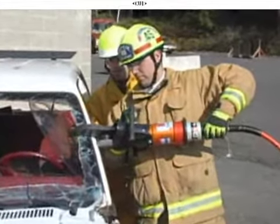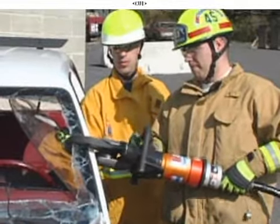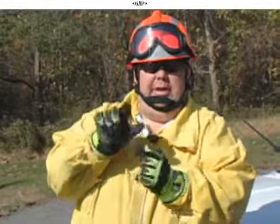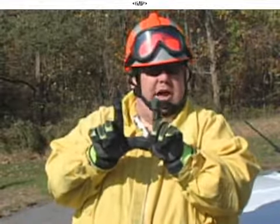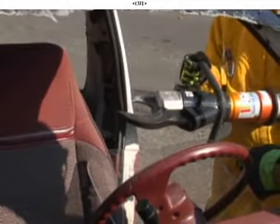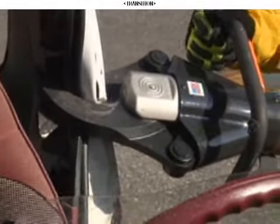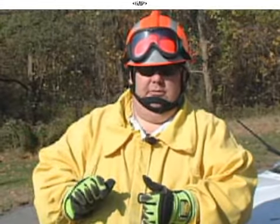We also want to make sure we cut at a 90-degree angle to minimize the side-loading force on our tool blade. When it comes to sheet metal, older cutters had curved blades where the tips come in almost like an earwig — the tips penetrate and hold the cutter in place. Some newer cutters have more of a U-shape because they're designed to cut hardened objects. Those cutters can be difficult to work with on sheet metal, as the sheet metal gets between the blades and causes twisting. Keep as close to 90 degrees as possible, and if it starts to move, stop, open the cutter, flip the tool over, and cut from the opposite direction.